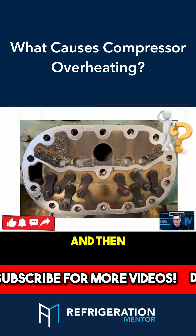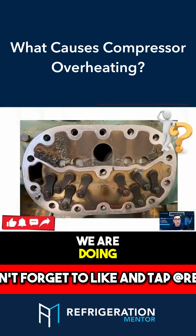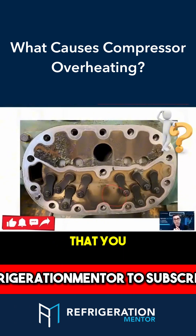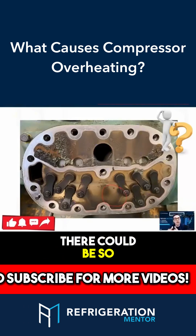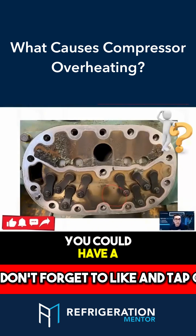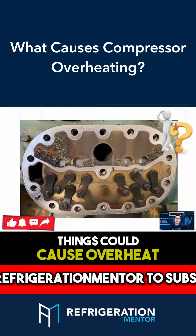I still think it's overheat. And high compression ratio — that's probably the biggest one. It could be for many different things. A lot of it comes back to what we are doing as professionals out there. Are we properly doing the maintenances? Or are the customers allowing you to do the maintenance? You've got the right refrigerant charge? Is it condenser fans, blades? There could be so many different things — plugged condensers, fan speed controls or VFDs. But it's even worse on the suction line. You could have a plugged TXV, a plugged suction filter dryer that may not even be in there. It could be low oil. So many of these things could cause overheat.